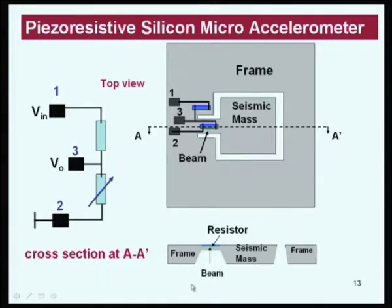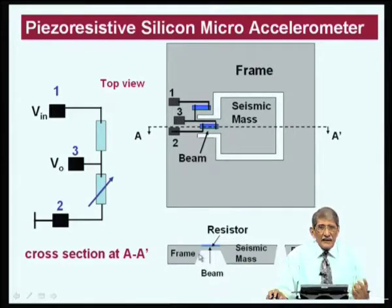The stress in the beam is monitored by placing a resistor on it. In cross section, you can see the frame, and the thin beam — 10 to 20 microns thick depending on required sensitivity. Thicker the beam, more rigid it is, so sensitivity is less. The spring constant is proportional to thickness cubed — if you double the thickness, it becomes 8 times more rigid. The length of the beam also controls the spring constant, which is inversely proportional to L cubed: doubling the length reduces spring constant by a factor of 8.